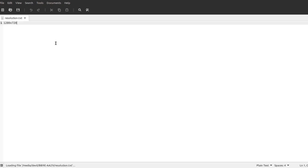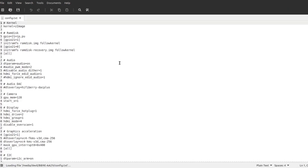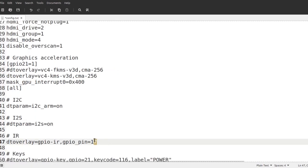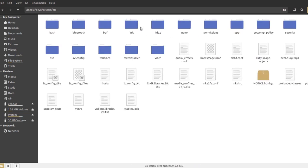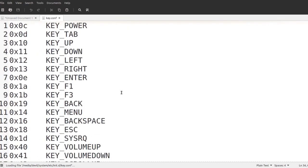Now I have installed the Android OS. Open the ConstAKang OS boot partition — this is the boot partition of the Android ConstAKang version I used for the Android TV box. You can see there is a resolution file and also a config.txt. You have to add the same dt overlay GPIO pin 17 line inside this config.txt. Next, go to the system partition, then the etc folder, and inside there you will find a folder called init.d, which is a boot script folder.